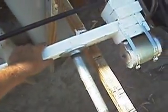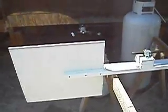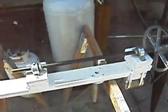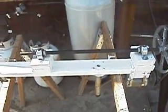That fits just about perfectly into one and a quarter inch EMT that I used for a mast. It is sensitive to how big the tail is — I first had the tail a little bit small and it didn't want to rotate. I don't exactly have any calculations for it, but it's pretty obvious when it isn't big enough. The overall length of the 2x4, which makes up the main body, is just a little over three feet, and I had the tail stick out quite a bit further. The way I located the pivot mount was just to find the balance point by picking it up — that's pretty easy to find. And of course I drilled a hole down the middle of it, and that's where the wire will go to the charge controller.